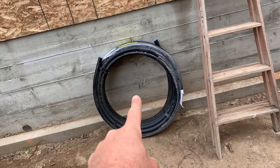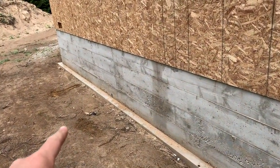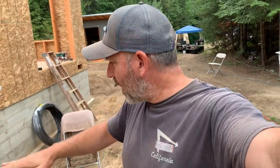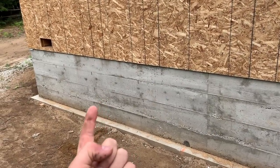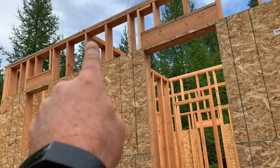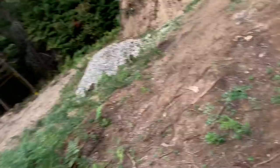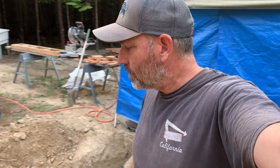Get this pipe right here into the house. We're going to go under the footer right here. We're going to dig down an additional 2 feet because we're going to backfill this about 3 feet. So we'll go down an extra 2 feet. That way we'll be 5 feet underground, just for 100% safety's sake. Pop up on the other side and then a straight shot right into the laundry room wall. Okay, so we'll have about 3 feet of exposed pipe before it gets inside the house, and we can insulate that really well. So we're going to dig about a 40-foot trench. Yeah, 2 feet deep.